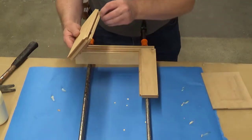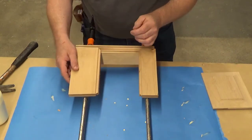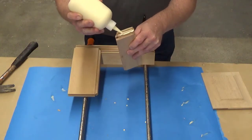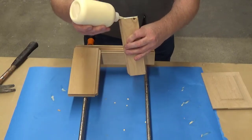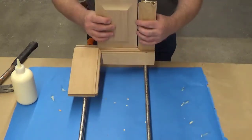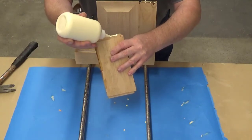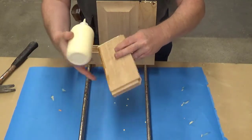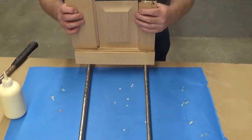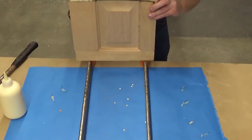Oops, lost one — just make sure that they don't roll away. I'm going to start the gluing process again: a bead of glue on each of the corners of the tongue, put it in place, get the panel in position, and then glue the other one. One thing you never want to do is position your top and bottom rails and then try to slide your panel in — that never ends well. So you don't ever want to do it that way.